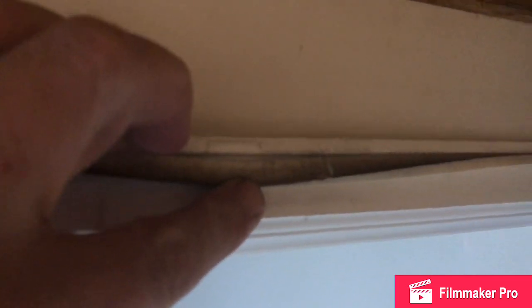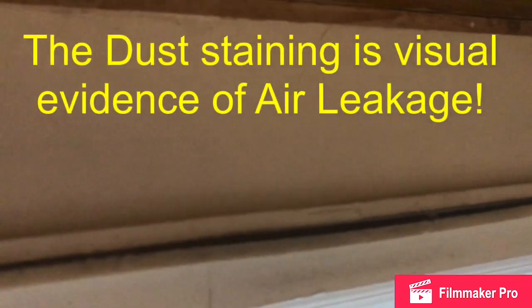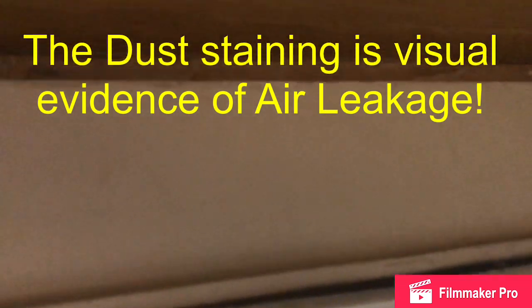It also sags slightly and there's evidence of air leakage and dust staining on the draft excluder I've put. So I came up with a solution and hopefully it will work. I've cut a piece of wood to cover the loft hatch — you can see my previous efforts and the dust staining where air's been leaking through. You can get a suction effect with a loft, a bit like a chimney, because the eaves are ventilated.